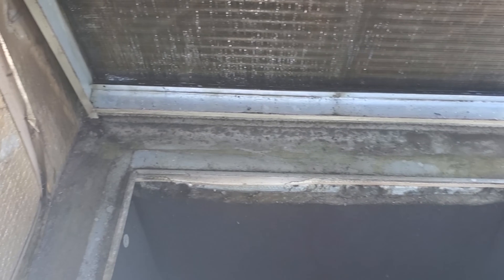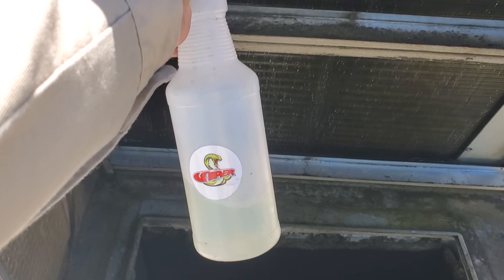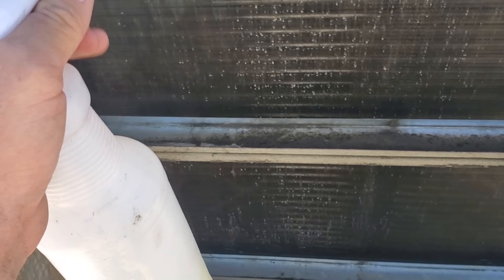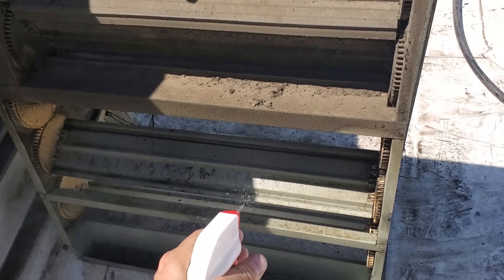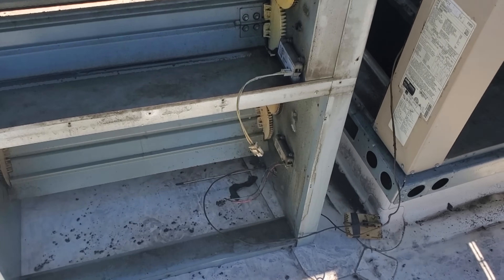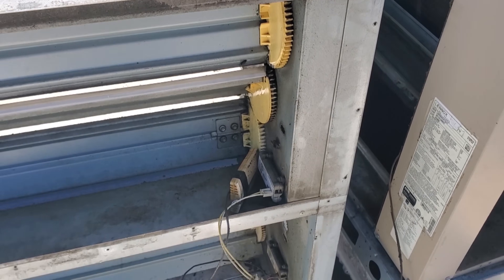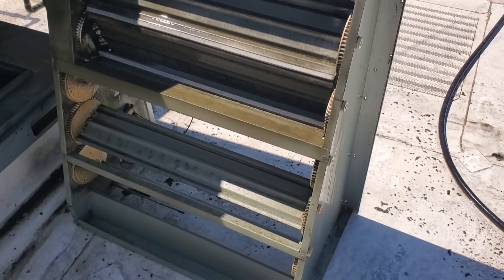My evaporator is looking pretty darn good — I'm happy with that. I rinsed it from the inside also. We're going to go ahead and start putting the filters back in. Before we put everything in, we're going to put some sanitizer — I've got the Strike Back sanitizer right here. Just spray this evaporator and you don't rinse the sanitizer — just leave it on every surface in here. This economizer, I'm going to give it a wipe down real quick. I very carefully tilted it and rinsed off all the big chunks of crap without getting it in the sensors and stuff, keeping the thermostat sensor dry and the actuator motor and all that. Get some sanitizer on that and then we're going to slap it back together.